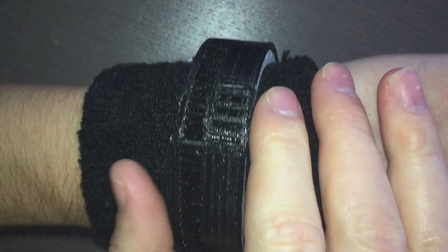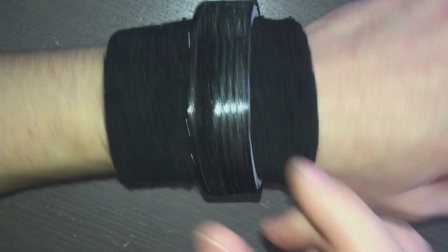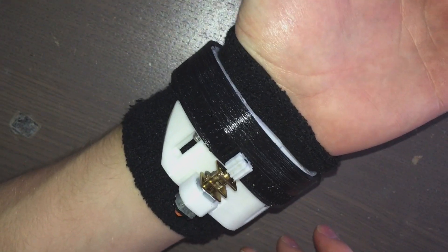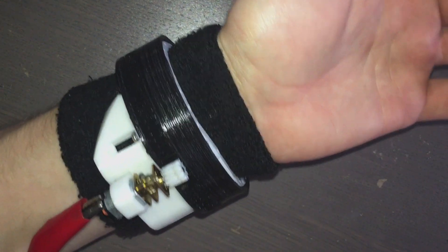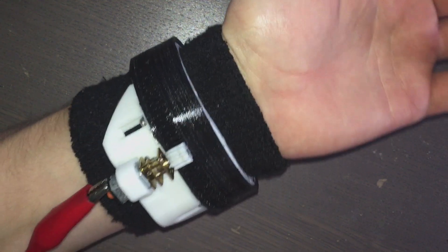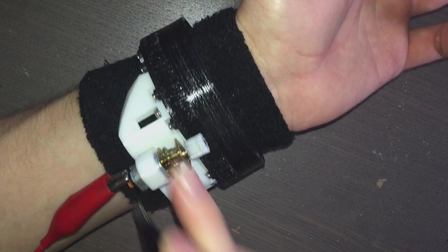All right, here's how that clasps together. There's a gap right there so it's probably not going to be the best — again, it's not very well constrained in this direction. We'll see how this goes; I'll see if the gear can skip over there. Obviously the clasp is going to need some redesign. Let's attach some power. I've upped the voltage to eight and a half and discovered that I need to hold this down — otherwise what will happen is this: the motor comes loose. I need to hold it down while applying voltage, so obviously this mechanism is going to need some redesigning.